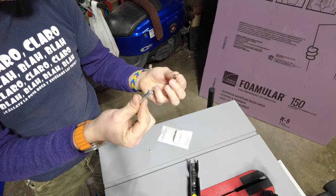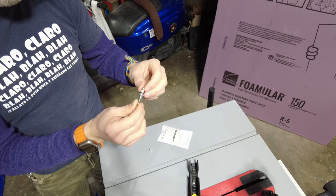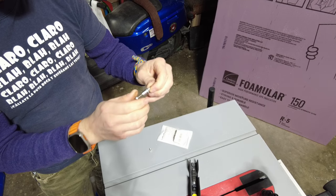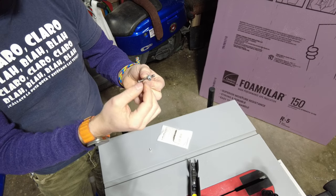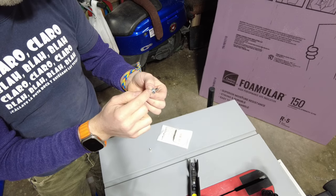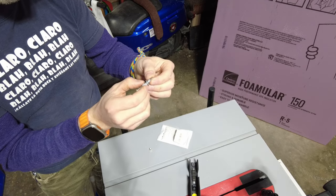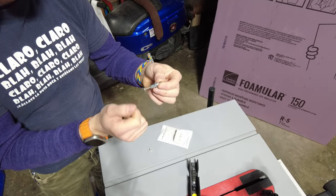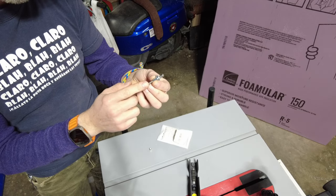So you've got a threaded rod, or in this case a bolt, and you put it into the rivnut. I've got a lock washer and a flat washer on here. And then this collet - it's basically a huge nut. I got a longer one because the threads are very fine and I wanted to spread the strain of squeezing the rivnut over more threads. With a small nut I could only find ones touching about three or four threads, so if I can touch 10 to 15 threads I'd have less chance of stripping it out. This is my application tool to install those.